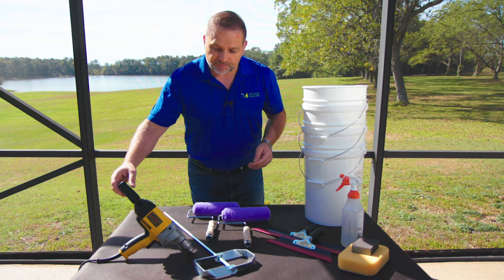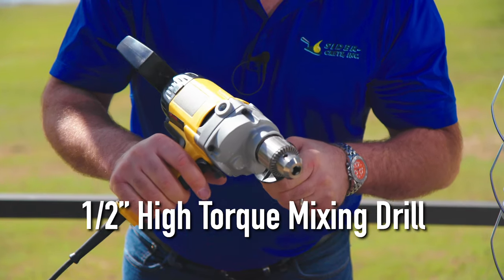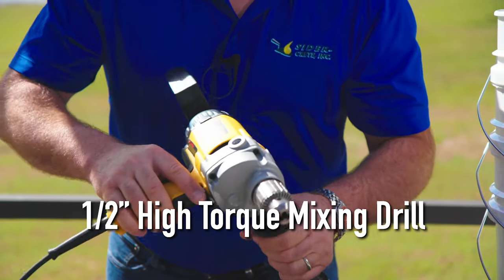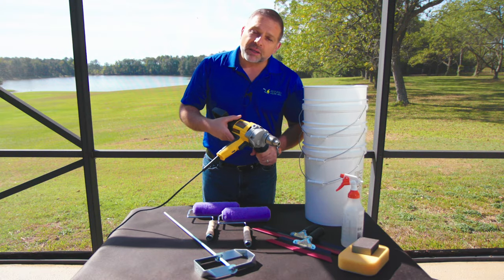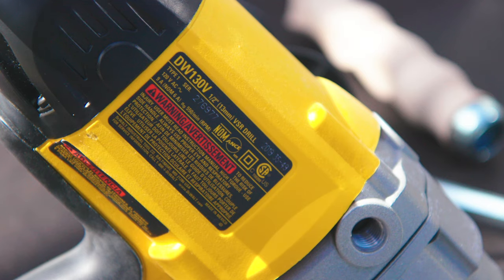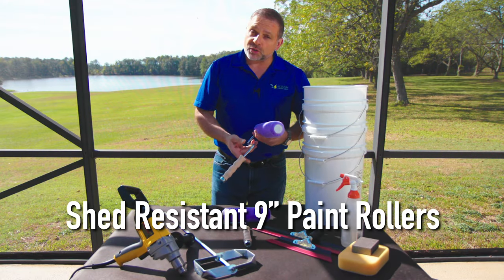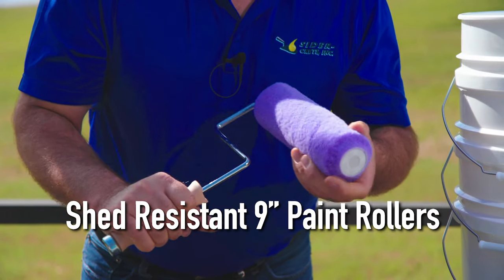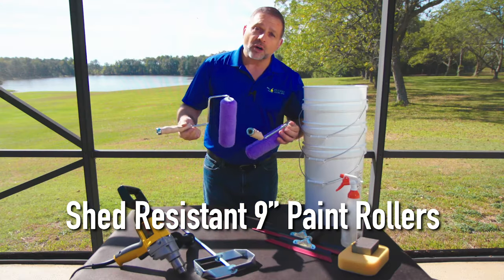As far as the drill, a 1/2-inch DeWalt model DW130V is the one that we favor. It is a strong drill. You will definitely need a solid drill with plenty of torque to mix that kind of material. Next, the rollers. These are just standard paint rollers with high quality roller covers. These are shed resistant, and just a couple of them will be needed for the application of our material on an average size pool.